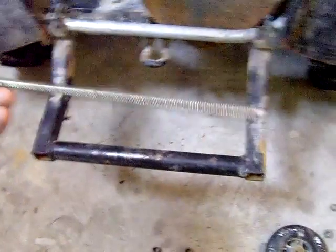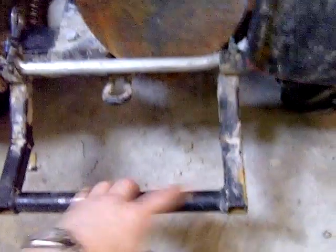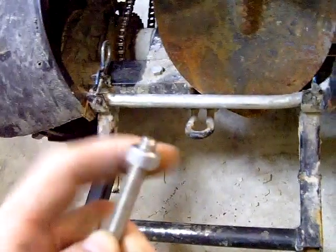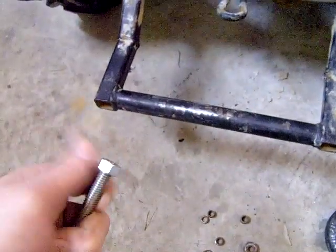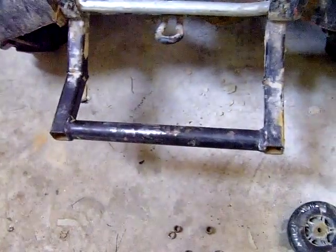Here's what we're dealing with. I just took a piece of threaded rod, drilled a hole in the end there, and welded a piece together so this piece of rod goes all the way through. One tip when you're cutting your rod: if you thread a nut on there first, and then when you grind the end off all around, you can screw it off and it sort of opens up the threads for you. You don't have to mess around trying to open up the threads — you screw that on there first, grind it, unscrew it, and you're good to go. So I'll stab these on there and show what this thing can do.